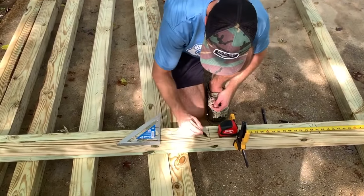You can see the power's coming in the bottom, and there is going to be the switch wire, which is going to the side light of the shed. And I'm repeating this process for the second light, that is drilling holes through the studs and routing the electrical cable from the light all the way around, as you're seeing now, to the power supply on the opposite side of the shed. So here's the routing. We're going above the roll-up door, and then we're going down to the actual power feed.